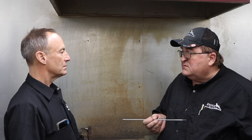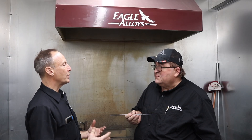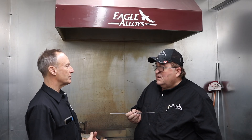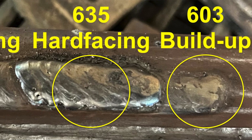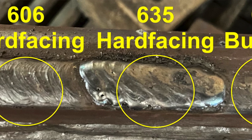What kind of metal are we going to use on this? We're going to use just common mild steel, but you can use this on shearing blades and agricultural tools where impact is a concern. And what would we put this on top of — what kind of build-up rod? You could use 603 as an underlay and put this over top, but this rod also can be a standalone product by itself.